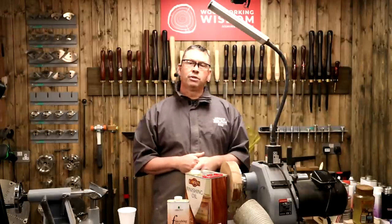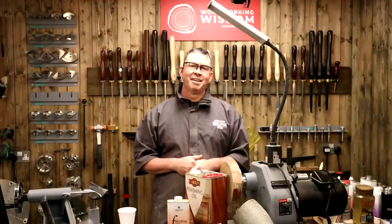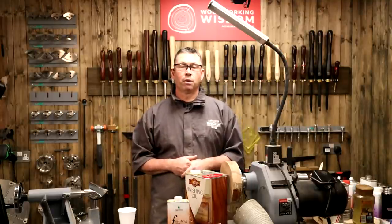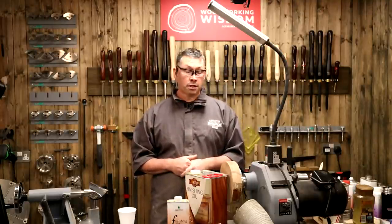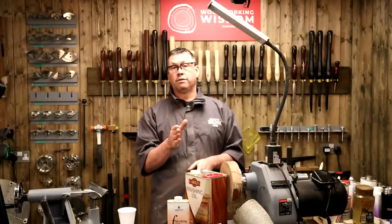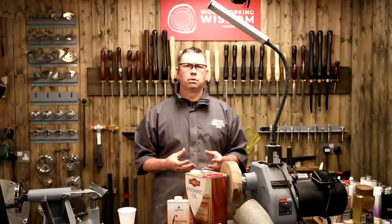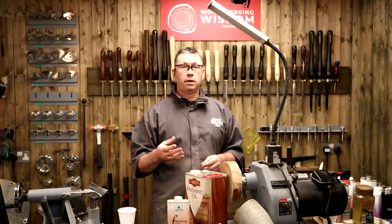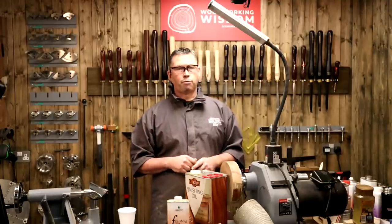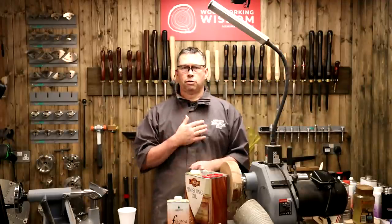In which case, if I was demonstrating for Terry or in front of him, I wouldn't dilute it in any way. My preference, hoping that Terry's not watching this, my preference and experience makes me dilute it every single time for the reasons that I've said. It penetrates better, especially on denser timbers. Leave it undiluted if you're using soft timbers, absolutely fine. But I prefer to use it diluted on denser timbers. That's my preference.